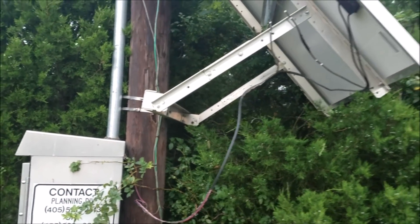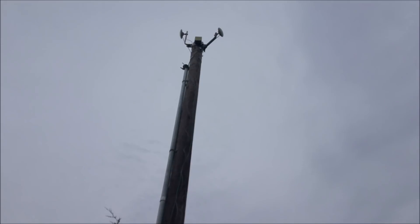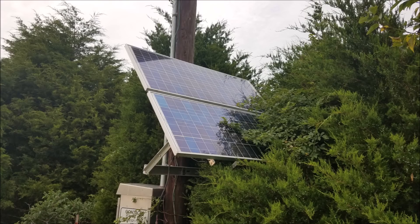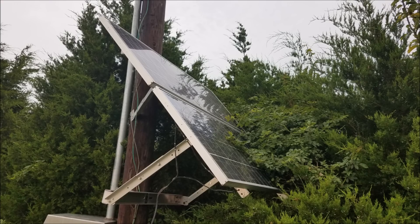There's a really crappy wiring job there too. They didn't even try to protect the wires — hide them or put them in conduit or anything like that. It looks like some animals have chewed on it. The funny thing is they put all the wires from the battery box up to the sensors inside conduit, but they didn't do it from the solar panels themselves to the box.